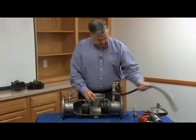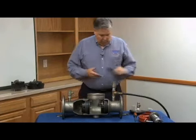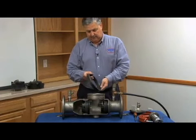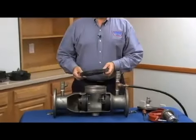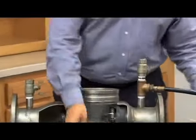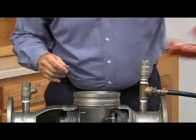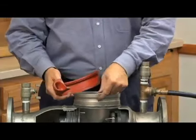So now I've got to get my gasket on the top here. What a grooved coupling is, it's something that's used very extensively in the fire business and starting to show up in more and more manufacturers, because it's an easily compressible gasket that seals kind of similar to an O-ring without the problems of a gasket. Now, the way it works is it's called a grooved coupling because the grooved coupling has two basic places that it holds on.